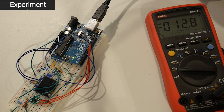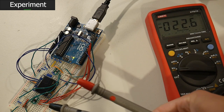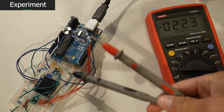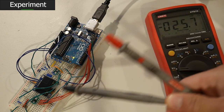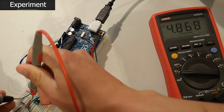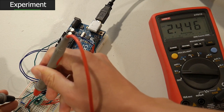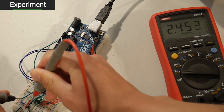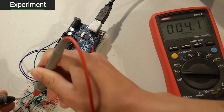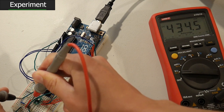We are at the bench. We've got the DAC down here and the ADC up there, but it's not doing anything right now. We've got the SPI interface coming back and some resistors to scale the output voltage as we like. We just sent 255 and we see 4.8 volts — we'll double-check that against the VCC voltage. Sent 128 and now we see 2.4 volts, so divided by two — that's looking very promising. Now let's wait for zero. We should see a drop down to — hey, look at that — three millivolts. Pretty darn close to zero. And then we should see one volt with the next output, value 51. Yes — look at that — just about one volt.